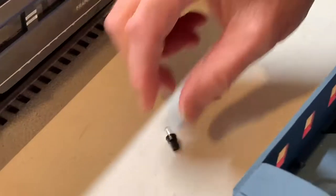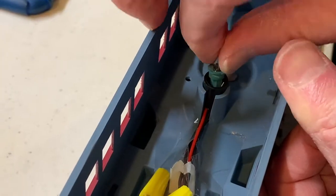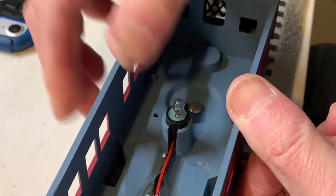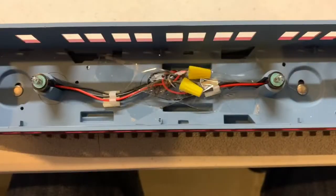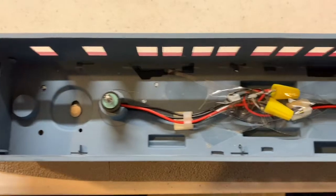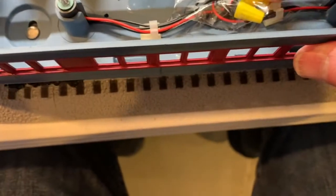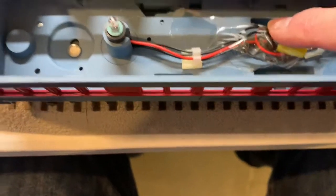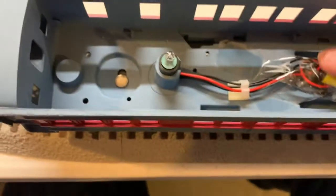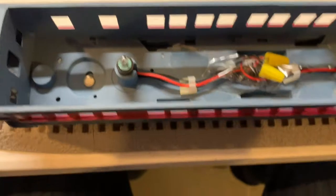Pinch, pull it out, get the new bulb — alright, exactly right, this way — and it's in. Now let's see if we got it working. So we got a little bonus on this video in that we now need to troubleshoot why these lights aren't coming on. As I was poking around on this where these wire nuts are, you can kind of see I get it to come on and go off, which means I've got an intermittent connection somewhere right in here.